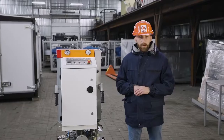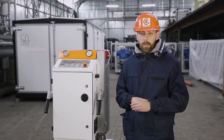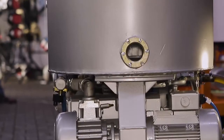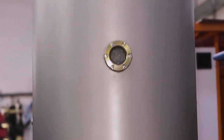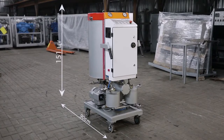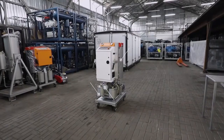The oil parameters at the unit outlet are compliant with Purity Class 9 of ISO 4406. Furthermore, it is possible to heat the oil by means of the CMM-1LT. With this functionality and capacity, the unit is very compact — its length does not exceed 90 cm, its height 150 cm, and its width 62 cm.